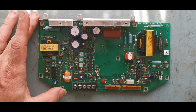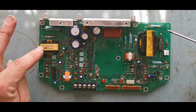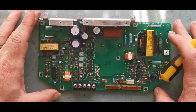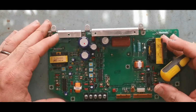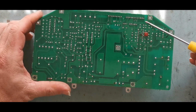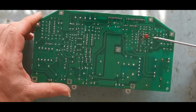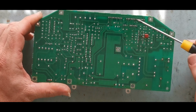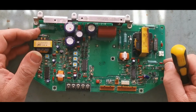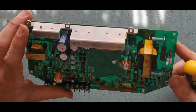On this side, most of what appears to be going on is the provision of the 35 volt supply for the receiver unit. And as you can see, they are very well separated. And on your edge connectors here, most stuff is just being jumped straight between what's coming back from the receiver and the output wiring. Motor is switched ground, which appears to be handled by this chip, which is a 4528 BP,